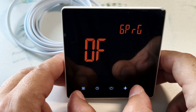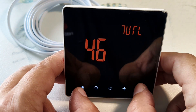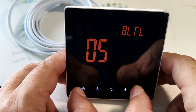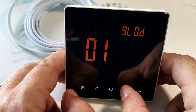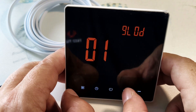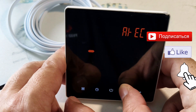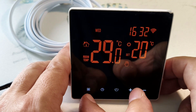If we turn on the off mode, the program mode is disabled. Next is the maximum temperature, adjustable from 30 to 90 degrees — I prefer to leave the default setting of 40 degrees. The minimum temperature is adjusted from 5 to 20 degrees — I set 5 degrees. Next, we set the load power: 1 is up to 1.5 kilowatts, 2 is up to 2.5 kilowatts, 3 is up to 3.5 kilowatts — I leave up to 1.5 kilowatts. Next is reset to factory settings — to do this, hold the plus key for 5 seconds. The settings cycle, then we turn the thermostat off and on to return to operating mode.